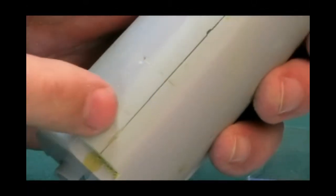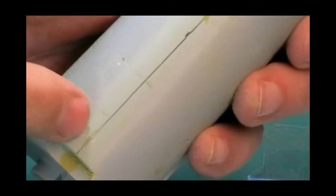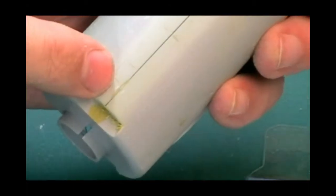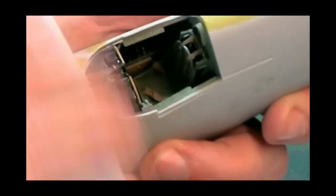Just bringing you all the way in — you may be able to see just on the nose here. This looks like a gap but it's actually super glue we've used as a filler. Down here we've got a bit of yellow, so we know there's a slight little hole. Judging by the little bit of white dust in it as well, we know that's a little sink mark and it's going to need a little bit more. We just carry on up this one to check it over.